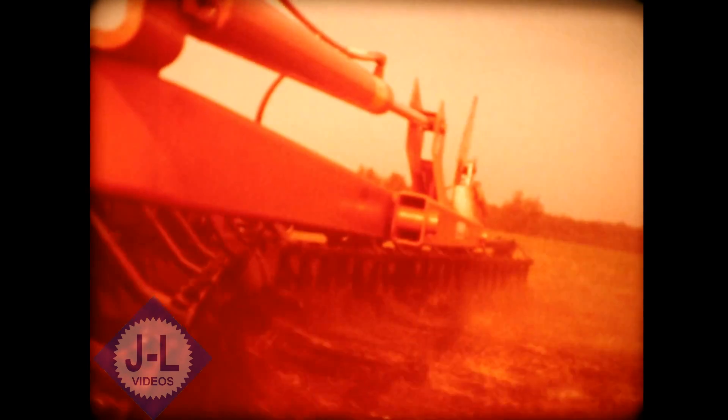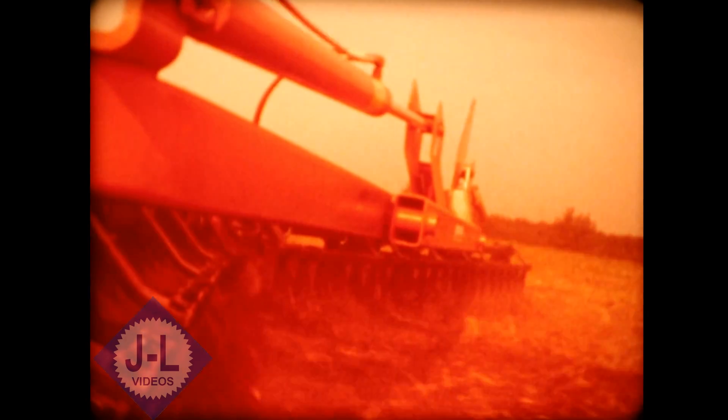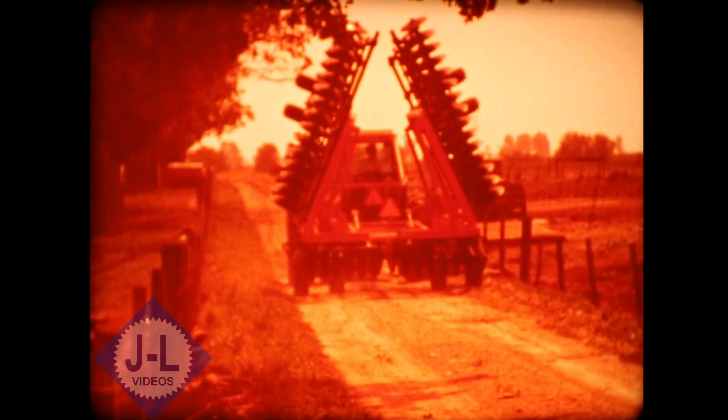Both front and rear gangs are easily adjusted to varying angles, letting you adapt your harrow to changing working conditions. Need more weight? All the disc harrow weight you want for hub-deep primary tillage is available in the model 2600 disc harrow from Allis-Chalmers. Whether it's primary tillage in wheat stubble, cornstalk disking, or general seedbed work, you have the weight and clearance to get the job done right. Hefty centerfold or wide-working double-fold models are available in 11 sizes, from 16 feet to our extra-wide 32-footers. Penetration from 118 to 170 pounds per blade. The gangs are fully adjustable at 14, 17, and 20 degrees to permit aggressive to moderate blade penetration. The wings float up 12 degrees and down 10 degrees to follow ground contours. Hydraulic cylinders fold the wings over 90 degrees for a transport width of less than 14 feet, even on the 32-foot model. Deep till or finish work, on contours or the level, the model 2600 will fill your need.